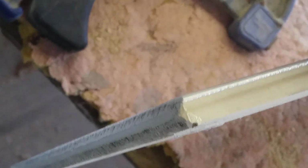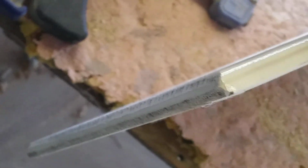So let's get this view. Where is it at? Gotta get it. There we are. Okay. You can catch the side of it. Here you can see it's starting to round. Okay. He's getting the bullnose. But it's too rough. Too much vibration, and that can crack your tile. If it was granite, it may not matter. But granite's not going to cut as easy, that's for sure. All right, so I'm going to put on this diamond blade.